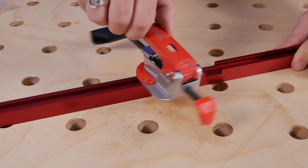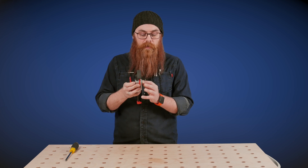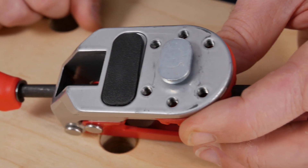It is repeatable. It is good for making jigs that last forever. And if you need these for specific jigs that you know you will not ever change, you can just take the T-Track out altogether and put bolts up into these holes and hold it in place on your table, wherever you need it to be.